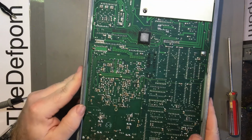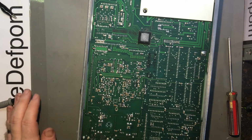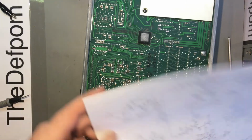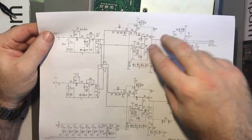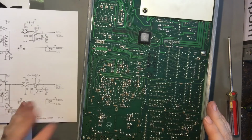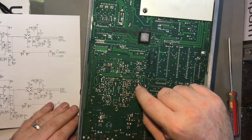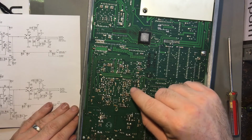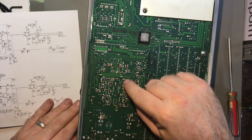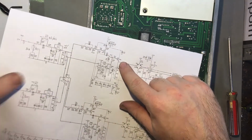Yes. Well, right. I was looking for those transistors. So you've got this one here. I want to check these, because if there's a fault with one of those, it could potentially cause the same symptoms. There are two transistors, one there and one here. I just need to identify which one's which. That one's really close to the diodes, so it's likely that's Q21.